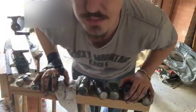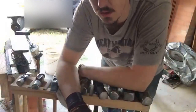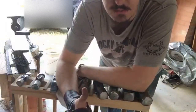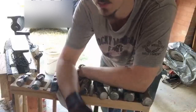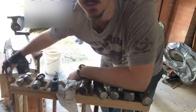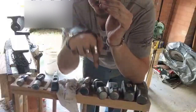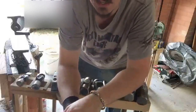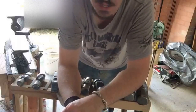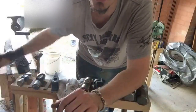It's because we're cheap. Anvil stands that are made of wood make a lot of sense because they absorb a lot of the impact. It helps deaden the sound, especially stumps. Or you can have fabricated ones that simulate what a stump does. It's basically taking energy that would normally blow out from the shock of things going down and refocuses it into a core. A trunk of a tree does that with a heartwood in the center. This stand here actually does it with a steel rod through the center.